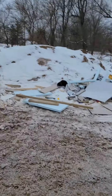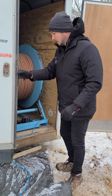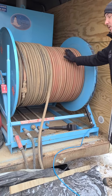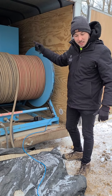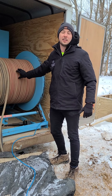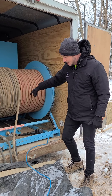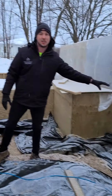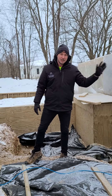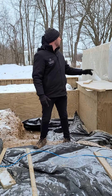Coming around back here — let's open this up. So right here, it's all of our heated tubes. This is actually quite warm to the touch; I believe it runs at about 180 degrees. Basically this just cycles through that boiler. You have this big spool, and you want to get your boiler going and leave it all spooled together so it can keep the heat in one spot. Once it gets hot enough, you can see it's running down into these blankets, into the foundation here.